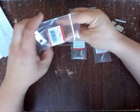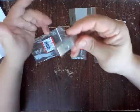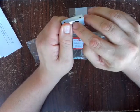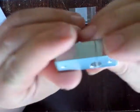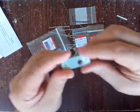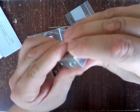So the next part — I splurged a little bit, cost 50 bucks, but I figured it was probably worth it because I really like this design. I've done a lot over the years with MK7 extruders which would thread into here, and I played around with a lot of different blocks. This one just looks pretty sweet. One major difference: on the original, the set screw applies pressure from only one side, so you only get good contact on that side. This one is a clamping screw — there's a little slot grooved in here. You don't have to buy this; you can buy just the nozzle and thermal barrier. But you can spend a little extra and get this custom machined clamping block. You insert it in and there's a clamping screw right at the end.